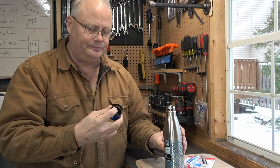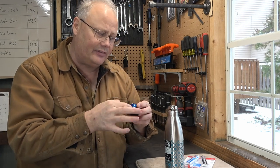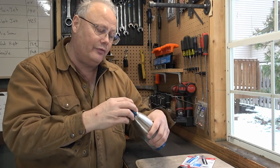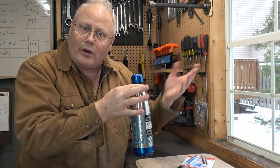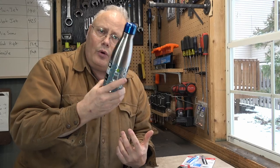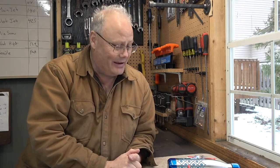I'm also going to look at drilling a hole through the cap itself so I can put a motorcycle vent cap — one of those little red ones — on the top, which will let some air into the bottle. The other option is just to unscrew the cap to let air in while the unit's working. I'm not planning on storing fuel in this; I'll only fill it when I need it and drain it back into the main fuel tank when I'm done, so I'm not too worried about long-term leaks. Okay, let's take a closer look and get this thing together — it shouldn't take too long and we'll be in business.